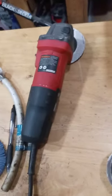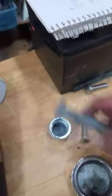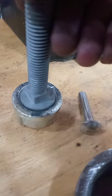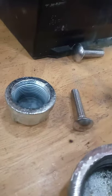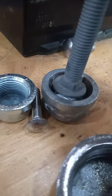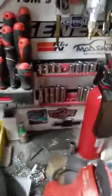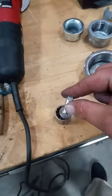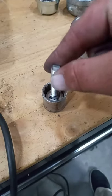When you get down to smaller sizes — here's your one-inch galvanized cap, here's your five-eighths carriage bolt. If you can see that, it's almost perfectly flush in there — there's your shallow one. Then you can switch over to your inch-and-a-quarter for a deep dimple. Another thing I was shown on YouTube: 12-point sockets. You can take your 12-point socket, take your three-eighths carriage bolt, and there you go — there's another way to make smaller dimples.